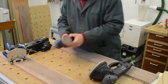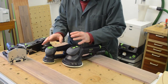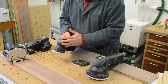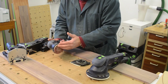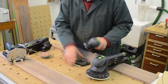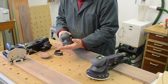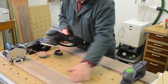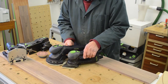I've received several questions from people asking which sander to buy first. I've got the Rotex 90 and the Rotex 150 and I absolutely love them both. If you're just going to buy one initially, I would recommend the Rotex 90, because it's so versatile — not only is it a rotary sander and a random eccentric sander, but it also has the ability to have the delta pad added, so you've really got three sanders in one. The Rotex 150 is great if you're always doing huge areas, but for me this is my first recommendation.